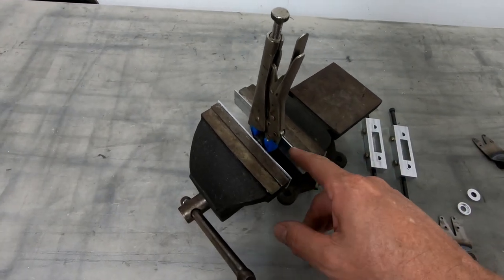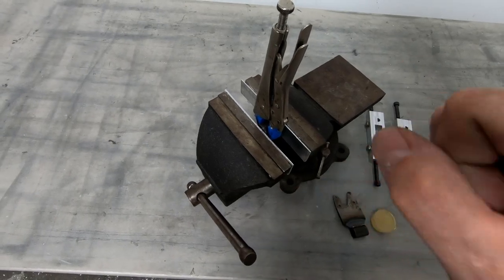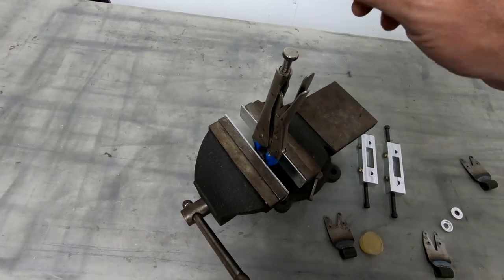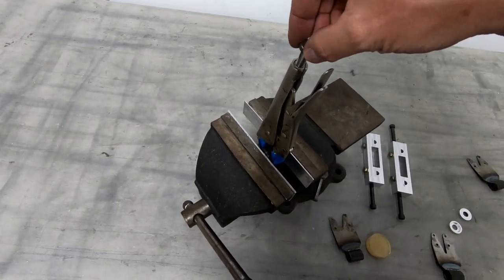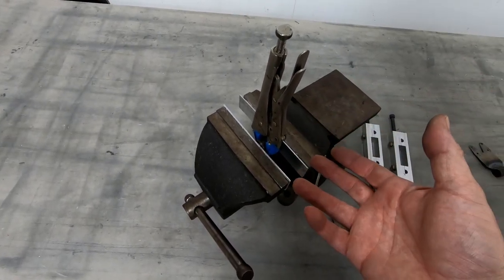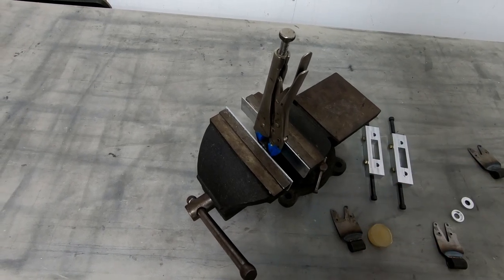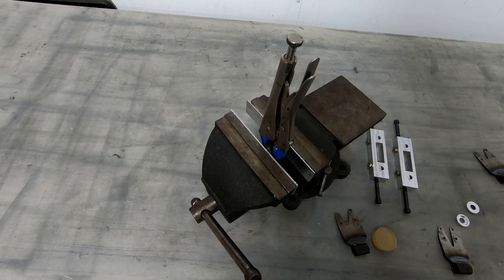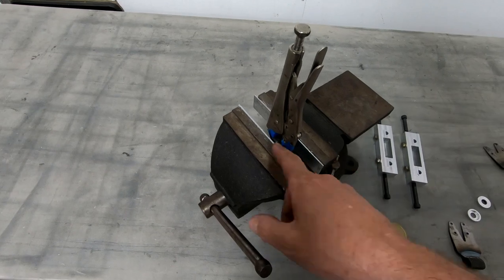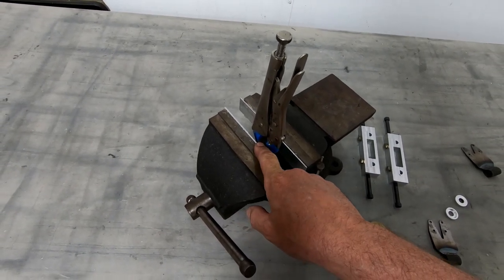All right, I'm laughing right now because I just had to redo this video, at least this part here where I was testing this. So I've got this clamped into the vise now. I've got vise grips on the outside of it, and what I'm wanting to test is to see how much I can rotate this and how stiff it is. Now, when I tested before with no weight on the landing gear, and then I put the gross weight on it, which was 400 pounds, we saw that the center of the gear bowed down, I think it was around 3/8 of an inch. That 3/8 of an inch at this bushing point would equal about 1.8 degrees of rotation.